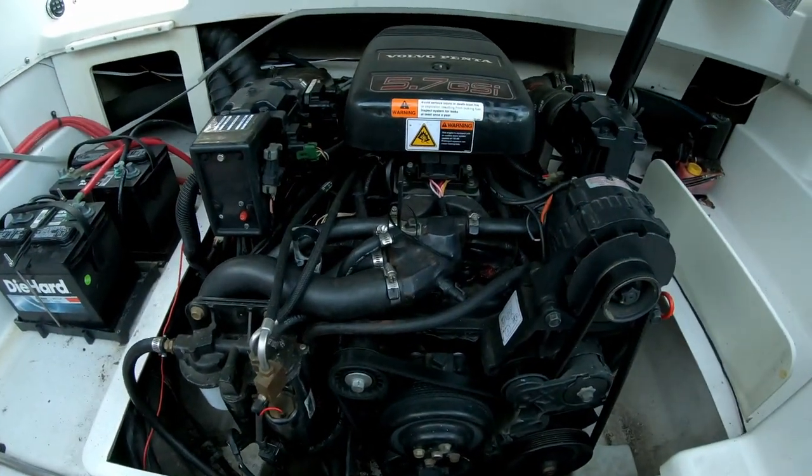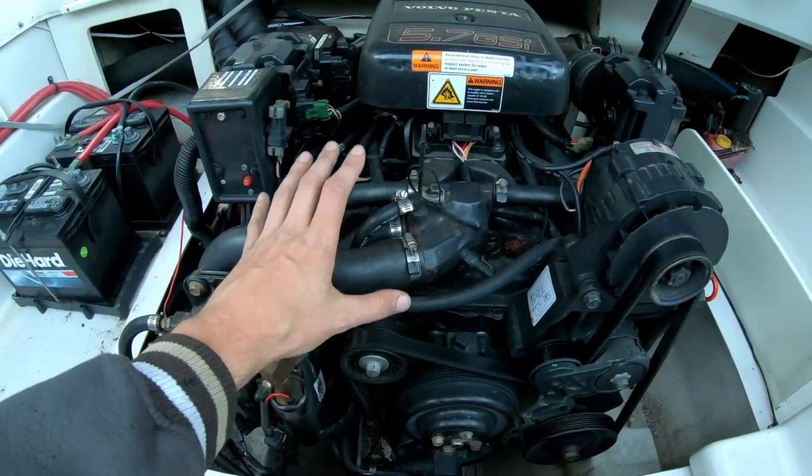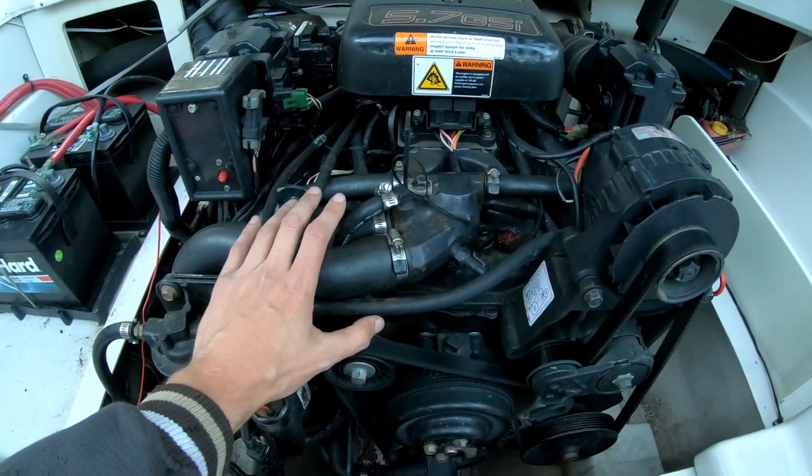As long as you can figure out what your specific boat has and does not have and address it appropriately — make sure you flush the water out. Sometimes with a heater core I'll blow it out with low pressure air. I'll have a link and pictures of all the various tools down in the description and on the website. For this video, I'm going to show you what you need to do to get your engine safe. This is a Volvo Penta with an SXM stern drive, mounted traditionally unlike some V-drive ski boats.